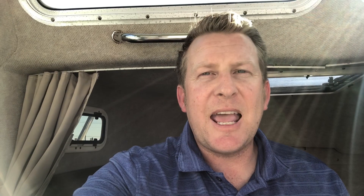It's a little bit different than an ethernet connection like what you'd have for sonar or radar. This bus is really simple — it's limited to basically a square wave signal, on/off in milliseconds. That's how it communicates, so anything numerical like GPS points, coolant temps, water temp, pressure — any data-related numbers, not picture-related — can pretty much be transferred over that bus.